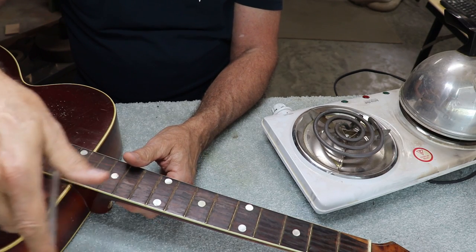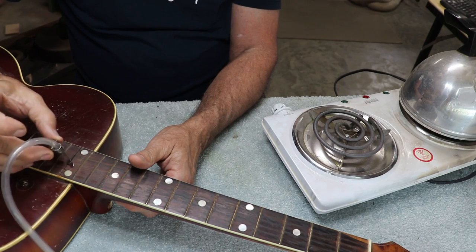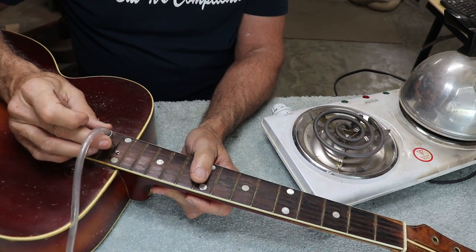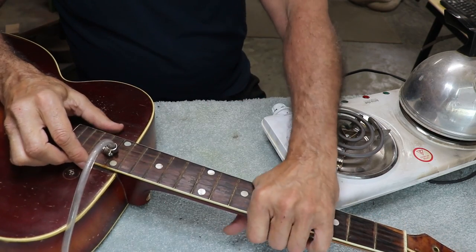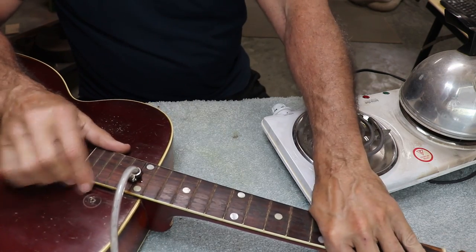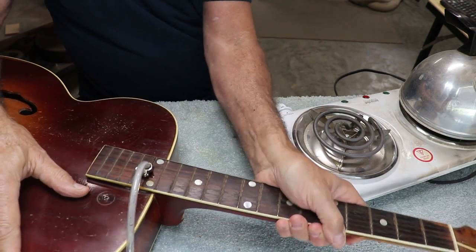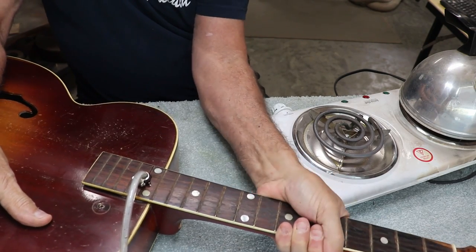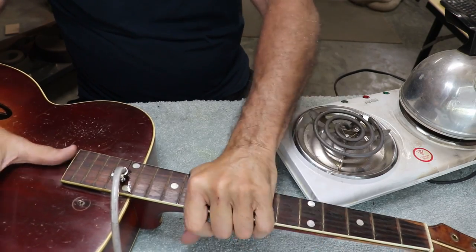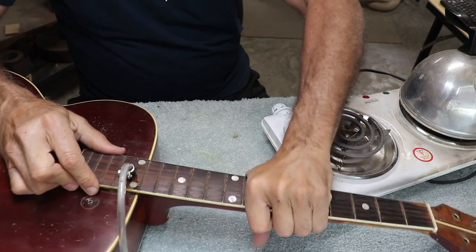This is very hot — I don't recall ever feeling it this hot, so the steam is definitely getting in there much better than it's ever done before. You can hear the steam escaping through the needle. No movement yet — it's a little bit like watching paint dry. I'll turn the camera off for a little while. Actually, no sooner than I turned the camera off I started seeing movement. The neck is moving back here especially compared to the top, and I'm starting to see moisture coming through the neck quite a bit. The more you wiggle it, the more moisture works its way into the cracks.